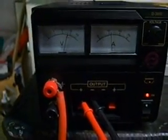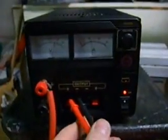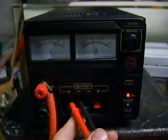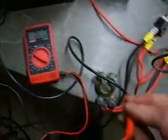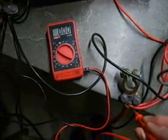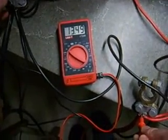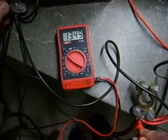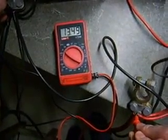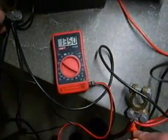I've got ways I can get around that problem. Right now I'm going to test different parts of this line to see what kind of voltage drop I'm getting. I'm checking the voltage drop just between these cables going from the power supply up to my old terminals. I adjusted the voltmeter so it was putting out exactly 13.8 volts on the power supply, and you can see it's pulling 13.49 to 13.5 volts over those cables alone — so there's a bit of voltage lost just through those cables.